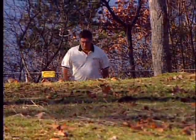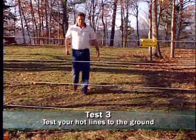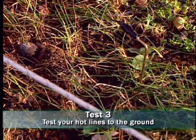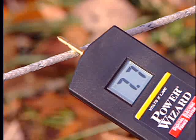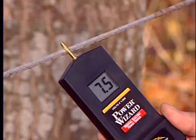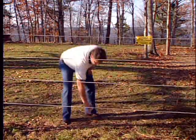The next test is the most important. Check the voltage of the electrified fence line to the soil. Place the ground pin about a half inch into the soil and test each positive line of Electrobraid. All strands should test above 5,000 volts. Repeat the same test at any high points and dry areas along your fence.